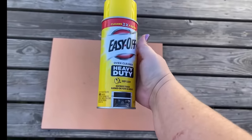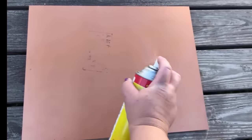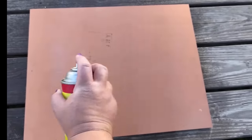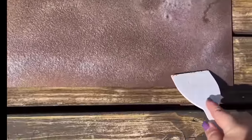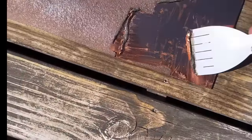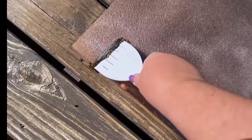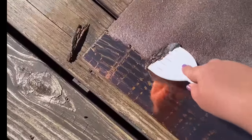The next step is to strip the paint off the back side of the mirror. Susan used Citrus Strip — I didn't have any and wasn't going to drive to town to get it, but I did have Easy Off oven cleaner. I was really hoping this trick would work to remove paint, same as I've used it for removing varnish off wood. I gave it a heavy coat, waited about 20 minutes, but it wasn't ready. So I sprayed more and waited an hour. After that hour, it was easily scraping off with my plastic scraper. Make sure whatever you're scraping with does not have slots in it, because it will make drag marks or lines that show up in your end project.